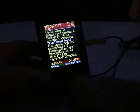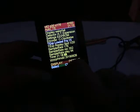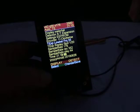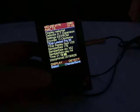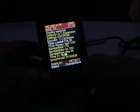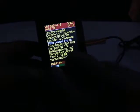In time expansion mode, the lowest frequency setting is a nice one. If you have a lot of near-ultrasound sounds around you — like from crickets — but the frequency is a bit too high, you can turn the frequency up, maybe to 35 kHz, and you can hear the crickets go silent. The time expansion mode is not triggered, but you hear the bat passing by. Since we also have some common noctule here in the garden, I'll turn it back down to also pick up the common noctule.